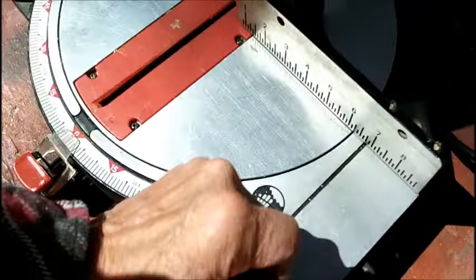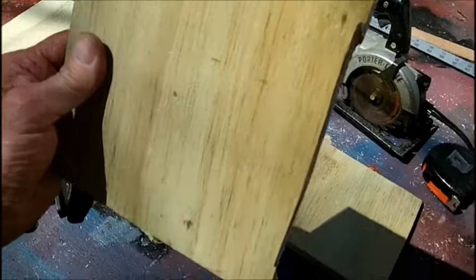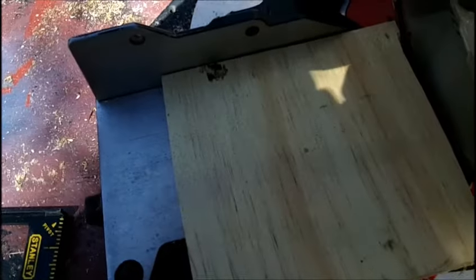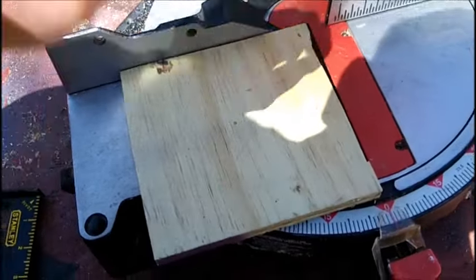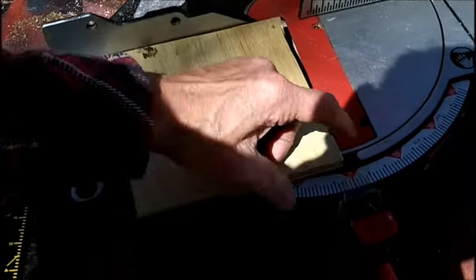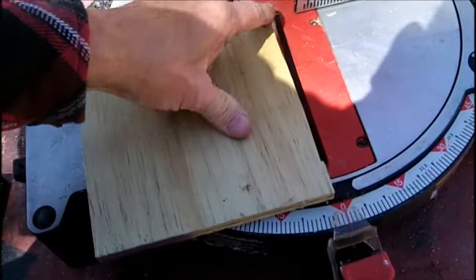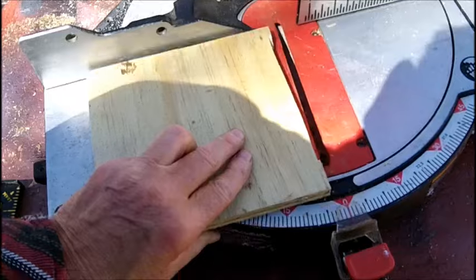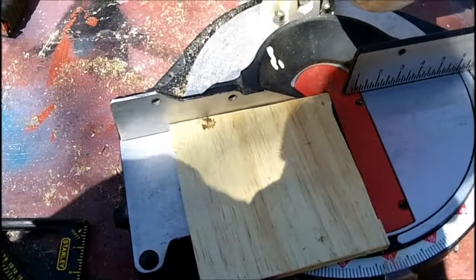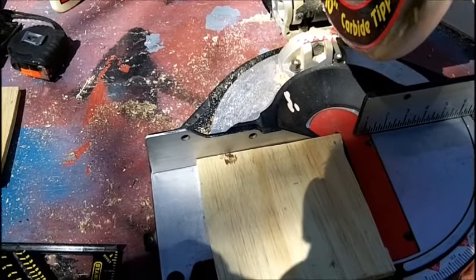I got to get this project started. I just don't know why this thing is cutting like this. The Ryobi didn't do that. This cuts from here to here but it leaves these little tails on there. I can understand leaving the tail on the far end because the blade isn't big enough to cut all the way through — I can cut down and flip it. But why am I getting a tail on the leading edge? That doesn't make sense. I think we're going to get the Ryobi out and put this away because I need good work and I can't do it with this thing.